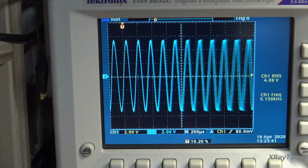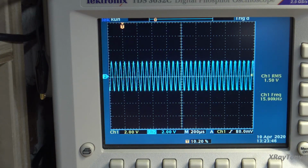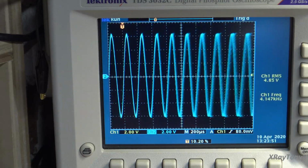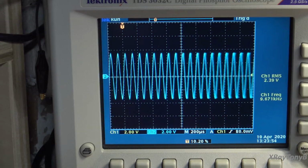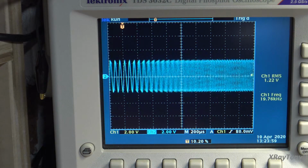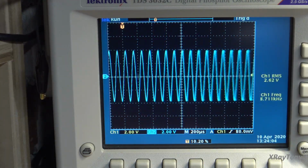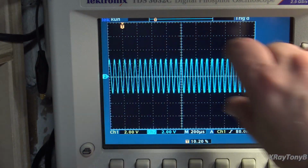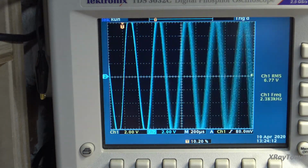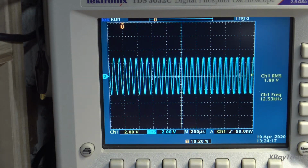What you're seeing right now is the influence of the RIAA equalization circuit in the phono stage of that amplifier. And there you go. You can see there's channel 1 and channel 2. They're overlapping right now, so you can see they're tracking perfectly together. Now remember how they stayed flat in the same amplitude the whole way? That's what our inverse RIAA circuit does. It allows us to check to make sure.